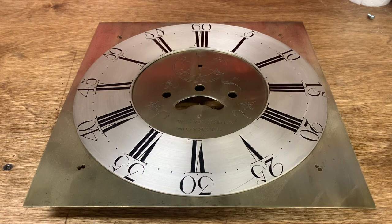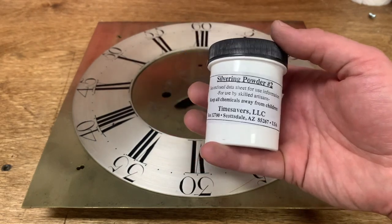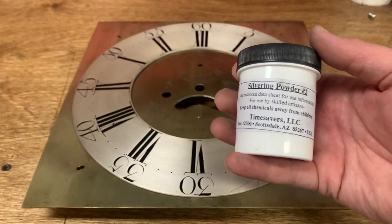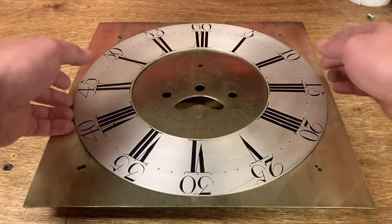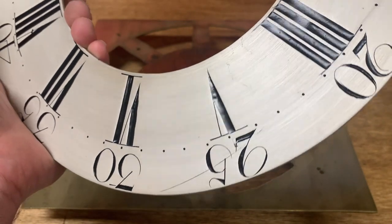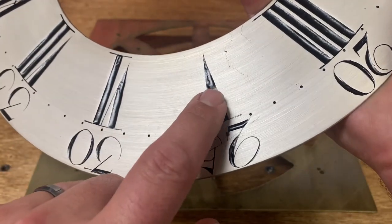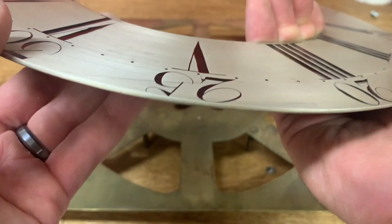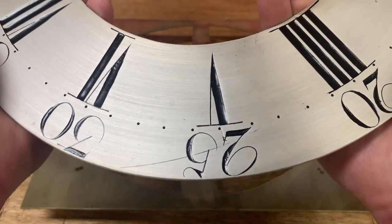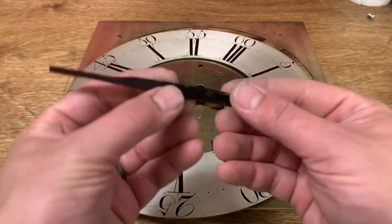Step two of the process is cream of tartar, and this is the same cream of tartar that you might find in your kitchen. You apply this after applying the silver chloride, and that brightens the brass to look like silver. Now, brass dials that were silvered — this clock is very old, about 1750 or so — were engraved by hand and/or machine, depending upon the circumstance and the era. The engraving is actually recessed, and the way that we get these nice high-contrast black numerals is to use engraving wax.